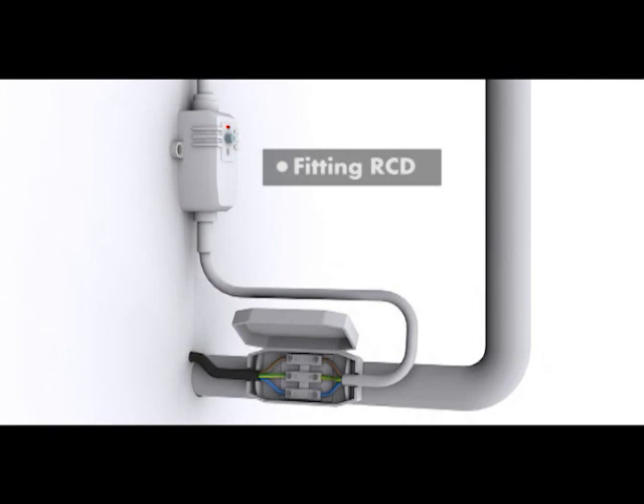To complete the installation internally, the heater cable flex should be connected in line with the British standard RCD rated at 30mA, with the junction box provided. The RCD and junction box has the facility to be wall mounted, and the 2m primary lead on the RCD should be connected to either the 3A permanent supply within the boiler or a local permanent power supply.